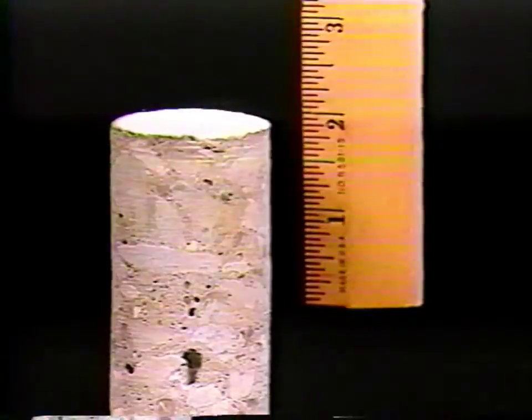How does it work? The VivoPak 100 utilizes a vibratory drum. Carefully adjusted frequency modulation on a rotating shaft within the drum sends a vibration through the concrete, forcing it down among the reinforcing steel and creating a stronger, denser surface down to a depth of 2 inches for a deeper wearing surface. And the denser surface will protect the concrete material from inevitable salt and water penetration.